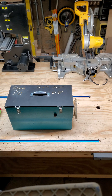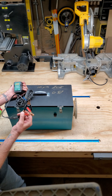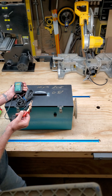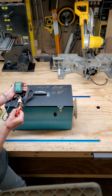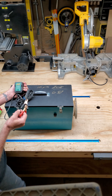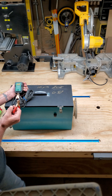If there are any questions you might have, please feel free to leave them down in the comment section and I will answer every comment as best as I can. One other thing I forgot to mention is this battery charger and maintainer — I got this off Amazon too. It will keep the battery charged and you can leave this on the battery when you're not running it — that's the good thing about a maintainer, it always keeps the battery at full charge. So you never have to worry about taking a half-dead battery out there. The 12-volt motor isn't pulling a lot of juice, so the battery lasts quite a bit. Beth and I have been out there running two to three hours and the battery would still be going strong.